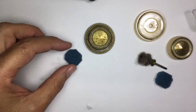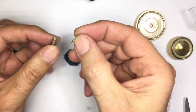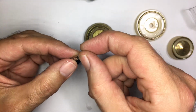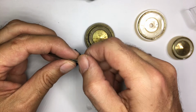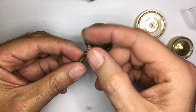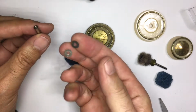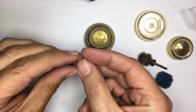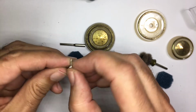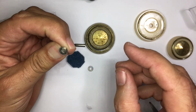That's done. And the next thing you're going to need is an adaptation that comes with the rotary tool. It's the mandrel with a screw at the end that is used to hold the sanding sheets, sanding appliances that they use. So this is basically just a screw at the end of the mandrel. You'll also need a couple of washers, any two washers, as long as they are the sort of washer that'll hold the screw and that won't go through the end. So the screw won't go through that, all right?